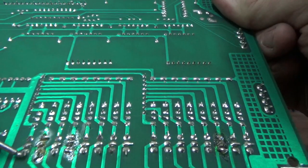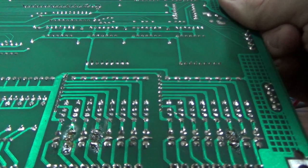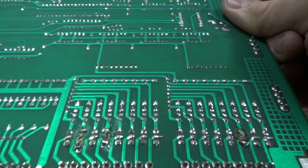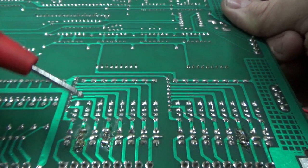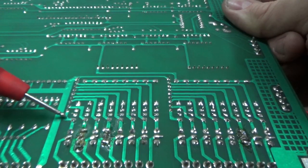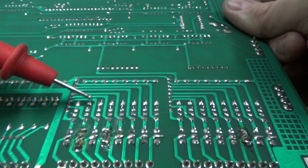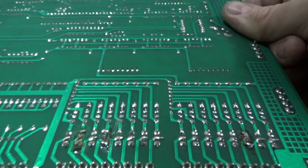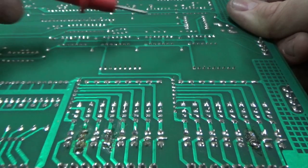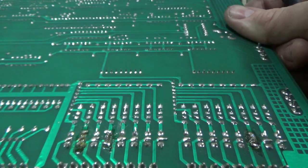Okay, so see what we're doing here? We checked this. It's good, according to my multimeter. Now, here's the kicker. It could be bad. Well, you know, sometimes they fail where you can run a tenth of an amp through it with these probes, but you can't run 5 volts, 12 volts, whatever it's running off of, through it. But we think this is good. Then we went up here to the pre-driver. We think it's good. Each one of these pre-drivers is connected to here, which looks suspiciously like a resistor network. And then I'll bet on the top of the board, each one of these is connected to something. Well, I know they will be. So eventually that's going to run back up here to these support chips. And so it could be we've got a screwed up support chip. Now notice that they have replaced the questionable transistor before. And they had replaced the questionable TIP36 before.